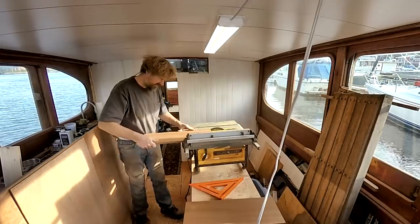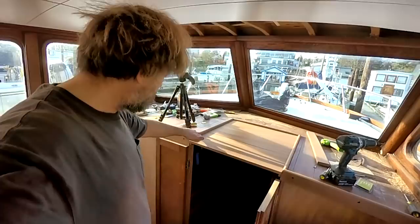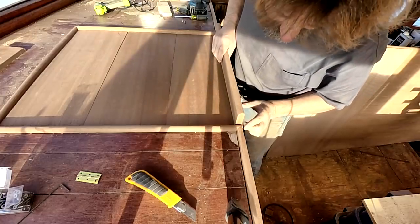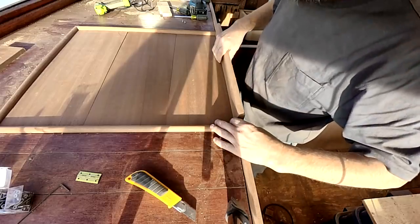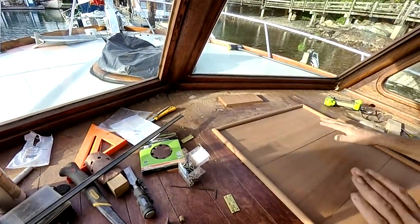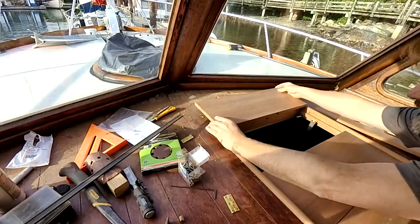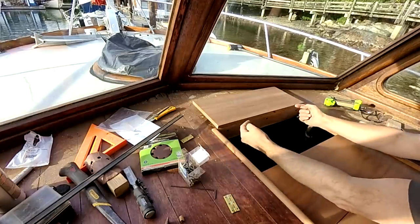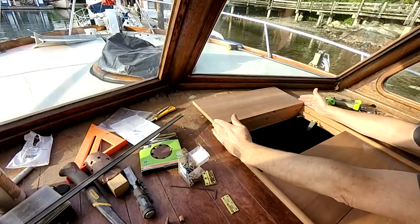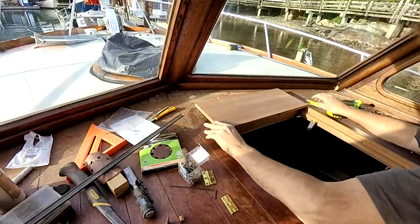Here's all three panels in — I'm really liking it. The combination of the three panels is a good inch too long, exactly an inch. An inch has to come off the three panels. I can do that to my advantage if I'm careful. When panel one flips up and over, it's going to be sitting basically flush because there are butt hinges on there. I'm going to take the entire inch out of this one panel, which brings the next butt hinge back, saving me some space.